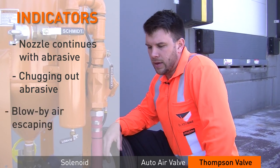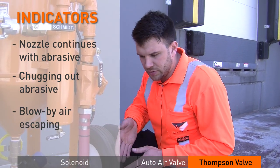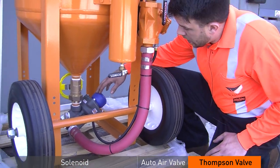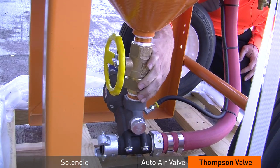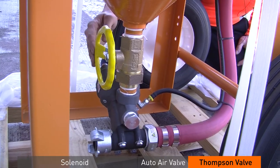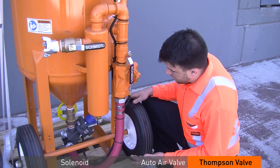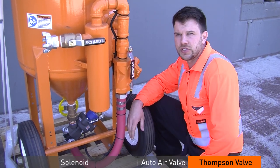Some more indications are blow-by — when your nozzle is laying in the sand, the blaster is on break, and you can see where it clears a little path. Air is constantly blowing out even when you're not hitting the trigger, which is an indication of premature or normal wear on the valve. If you shut off the union gate valve completely, you shut off the supply to the Thompson valve and shut down the whole system from leaking. If the air stops blowing out of the nozzle, you know right there it's the Thompson valve. If it's filling your hose full of abrasive or never shutting down, it's stuck open — a good indication to take it apart and inspect it.